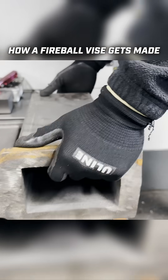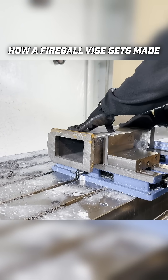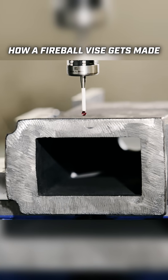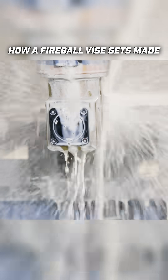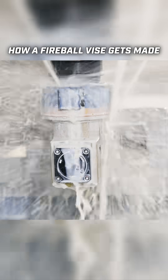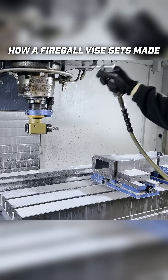This goes into our big VF6 mill. We'll take it and fixture it. Fixturing these parts is kind of challenging as each part is uniquely casted. We need to ensure that we're grabbing it in the same area, making sure we're not taking too much off of one side and we're more centered out to the part. Our tolerances for everything are really slim — within two to three thousandths per part — so there's very little margin of error.